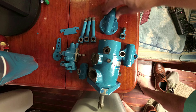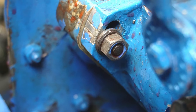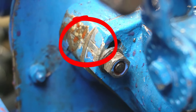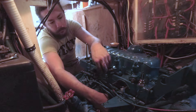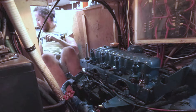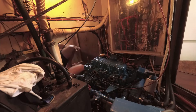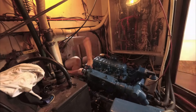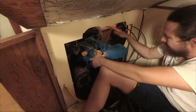Replace the seals that need replacing and put the pump back together in reverse order of how you took it apart. Remember — and I cannot stress this enough — when you put this back on the engine, align the marks you made previously. The rest is as easy as reconnecting your fuel lines, getting the exhaust manifold back on, then your coolant tank, and refilling your coolant to an appropriate level.